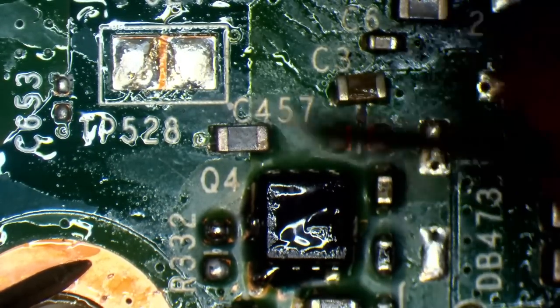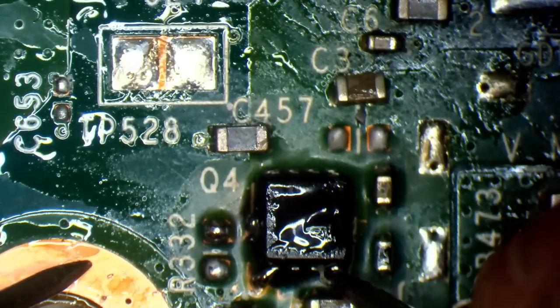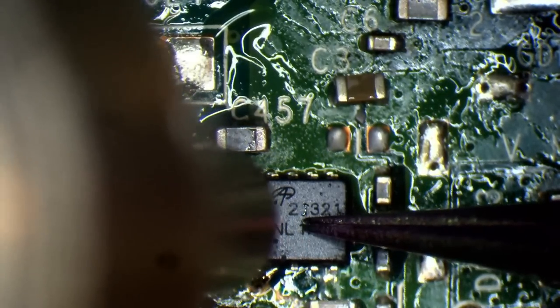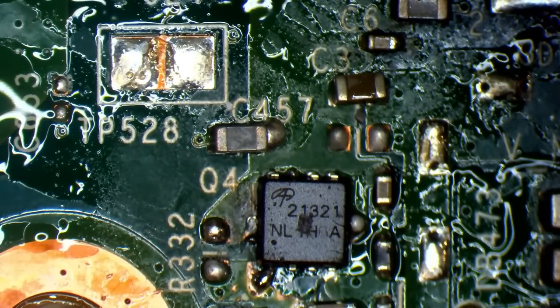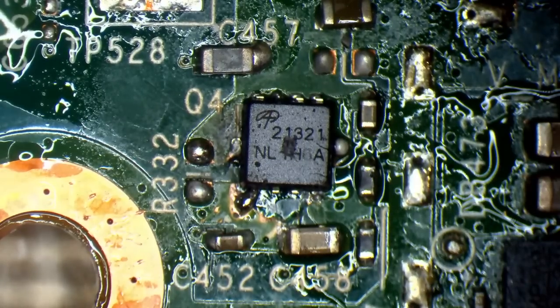Diode mode gives me a voltage drop across the ground and tells me an accurate reading. Red probe on ground — we've got 2.7 volts on that side. That MOSFET might not be connected — that could be it. I thought that was sufficient, but evidently not. I'm going to push down on it — could be that it's sitting a little bit too high. Let's test again: 1.13, 0.3 — getting a good reading there now. 0.35 — yeah, I'm getting good readings now.